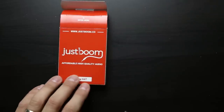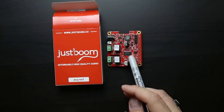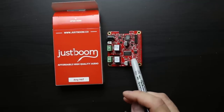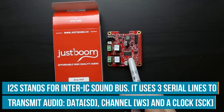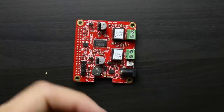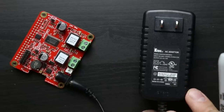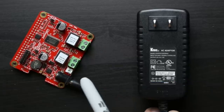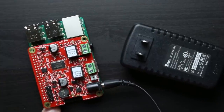We're also going to use the JustBoom audio amplifier. We're using a TAS5756M Burr-Brown/Texas Instruments Class D closed-loop amplifier. It basically uses I2S, which is kind of like I2C but designed to stream audio between chips. It has a barrel jack, and what's great about that is we can power it directly. I'm using a 12V 3A power supply from my external hard drive, which is enough to power both the Raspberry Pi and the amplifier. Slide it on, install the mounting hardware, plug it in and configure it.